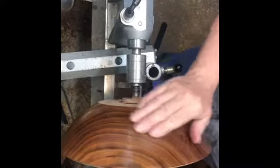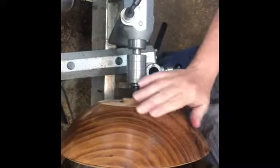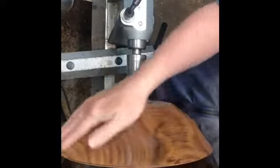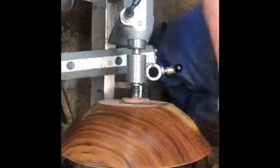I don't feel any moisture, no stickiness. There are areas that I can feel there's more finish on it than others. And that's okay. I don't have to have a perfectly even finish at this point because I'm going to put abrasive paste on there.